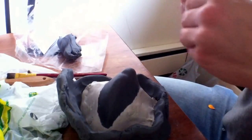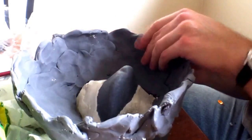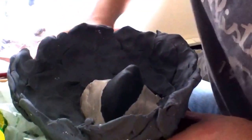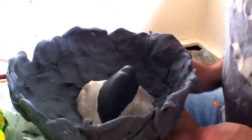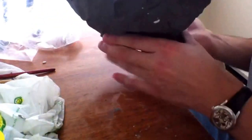As you can see the clay wall is getting to a decent height above the sculpture. If I did this again I'd probably use more clay, because the clay walls I made were a little bit flimsy and kept sagging a little bit. Either that or I would take some sticks and make a structure so that the clay walls stood up more, as you'll find out what happened in just a second.